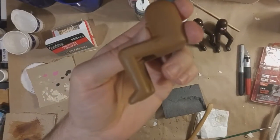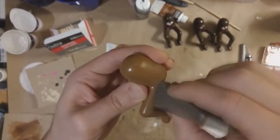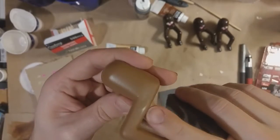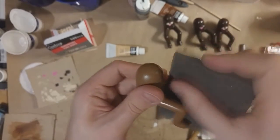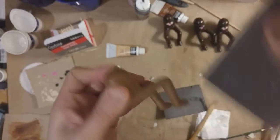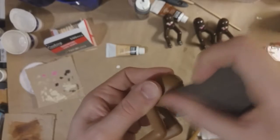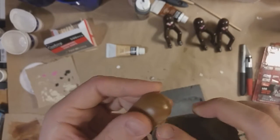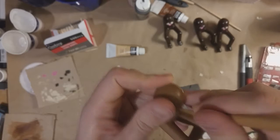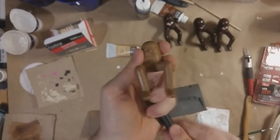The painting process was fairly straightforward. First, grab the sanding sponge and hit any high spots, areas where paint had globbed up or dust had gotten stuck. While it might seem counterintuitive to kind of ruin the paint job before finishing the details, these lightly scuffed areas where the finer end of the sanding sponge hit them will actually become more uniform in color after they've been hit with the final clear coat enamel. It looks a little lighter and dustier where the sanding sponge hit, but once the clear coat is on, the color becomes uniform and smooth again.